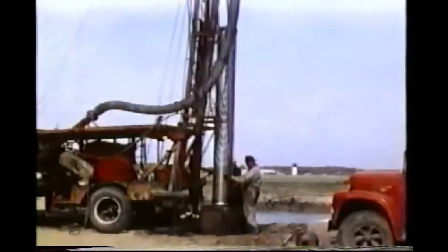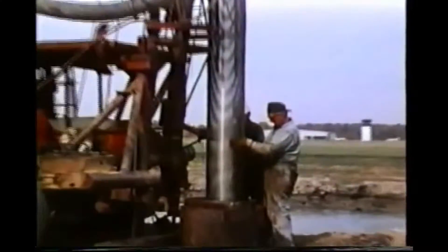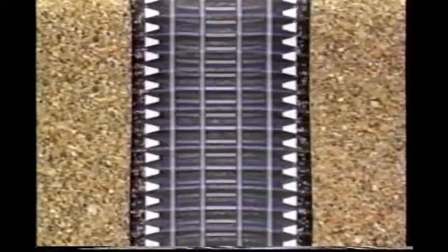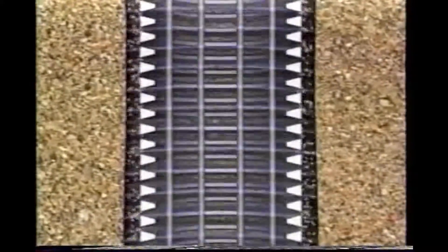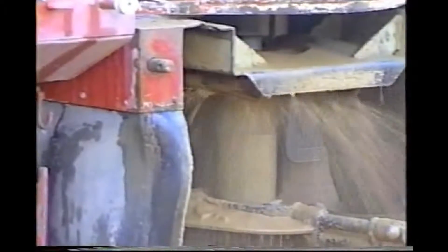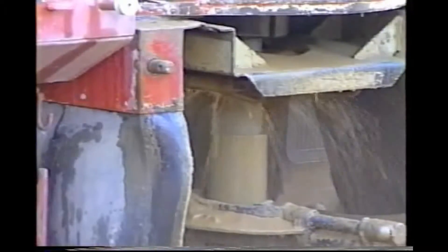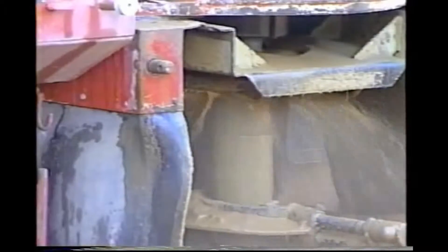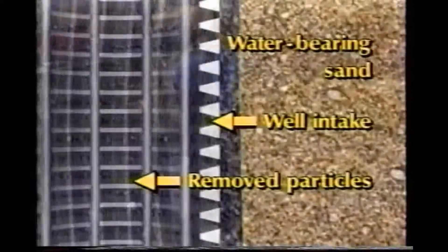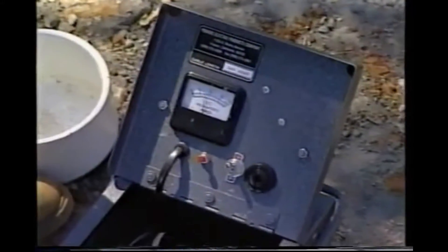Sometimes most of the space is filled with fine rock pieces from drilling, and then the top 20 feet is grouted with cement or bentonite. If the well is drilled into rocks that are crumbly or into sands and gravels, a well screen probably will be needed. The well screen is a sieve- or strainer-like cylinder attached to the bottom of the casing. It allows water to flow into the well while preventing fine rock particles or sand from entering. The well driller will select the opening size of the screen depending on the size of the rock fragments or sand that make up the aquifer. With the casing and well screen in place, a flushing or back-washing of the well may be performed to eliminate loose fragments and stabilize the area immediately adjacent to the well intake. This is called developing the well.